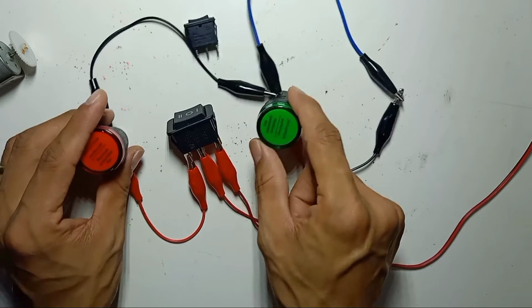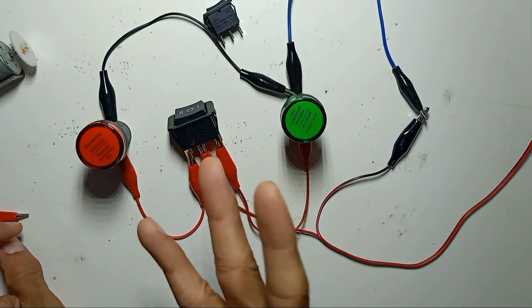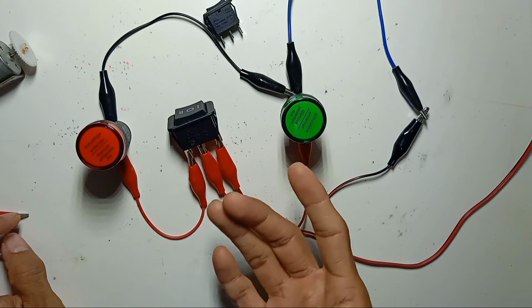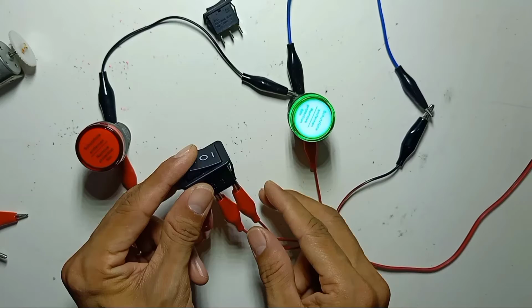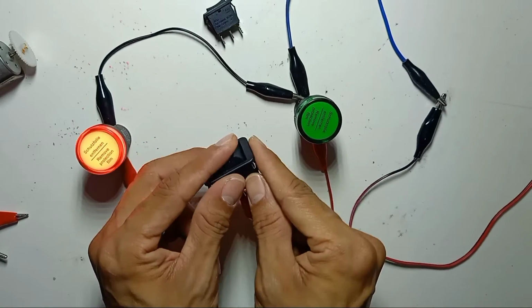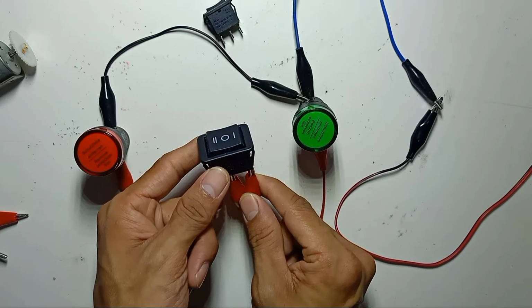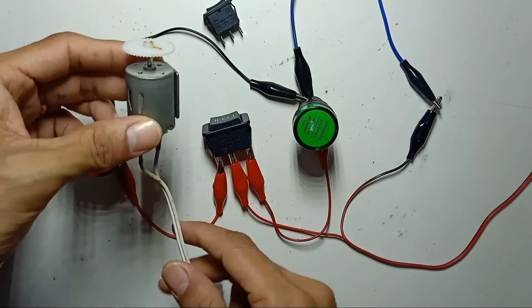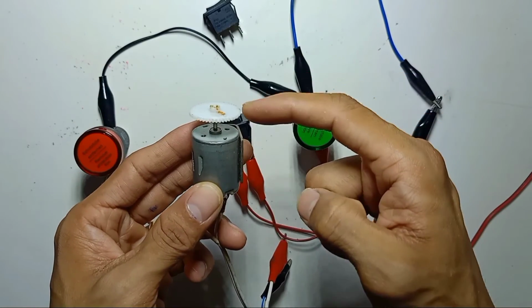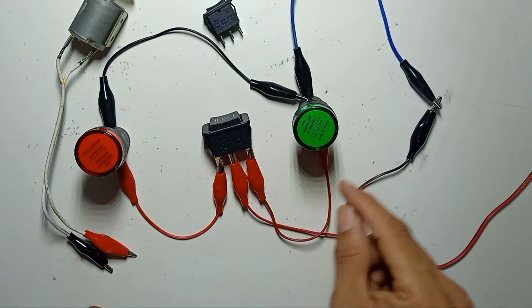Which means in this position, you can use this switch to control 4 lights. You can control 4 lights to make them on and off, but I just use it here to control 2. The good use for this 6-pin center off is especially for the DC motor, which you can make forward and reverse. So how we're going to wire it is,